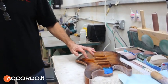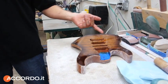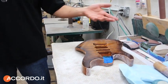If you put polyester on thin, it'll sound great. That reputation came from a lot of builders in the 80s using thick layers of polyester. That is the problem — when some of the larger manufacturers used to put on too much. The problem is when you're sanding, if you go through the clear and hit the color, it has to go back to the beginning. So what big companies would do is just put more clear on so they have more to sand.